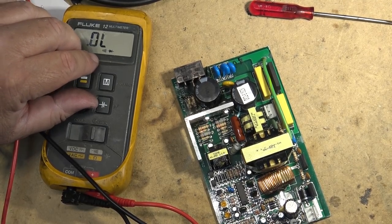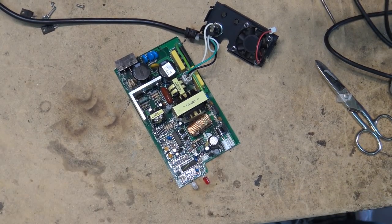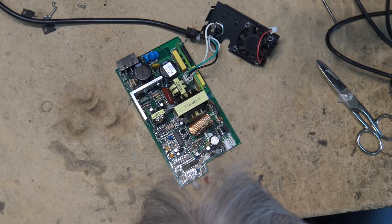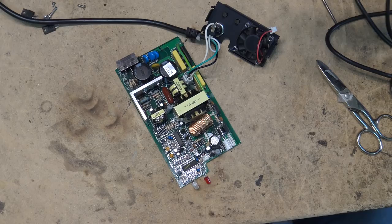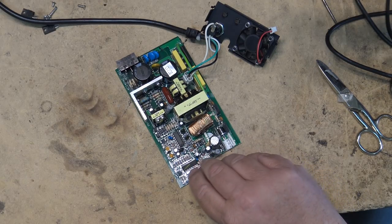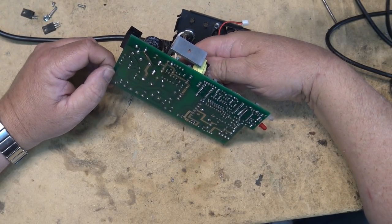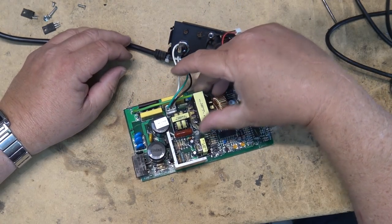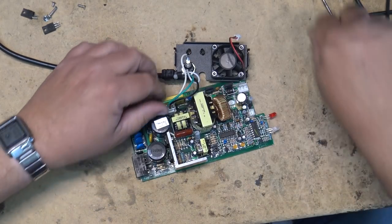I'm not going to spend too much time on this, but we'll see if I can get it to fire up. I put another resistor — I just bridged it over top of the one that's open. I know it's a little bit higher in value but I just want to see if this thing turns on. And it does not — so we still have an issue. It's more than just that. At this point, this thing is probably not going to be economical to repair after all — it's just a battery charger, probably not worth more than 30 or 40 bucks to replace. I was doing this as a favor. Oh — hold on. Okay. I feel like an idiot now.